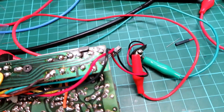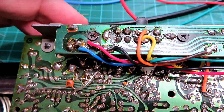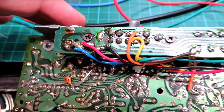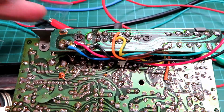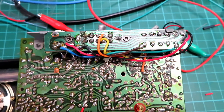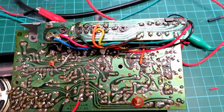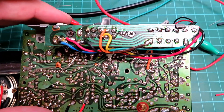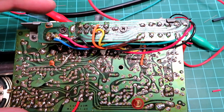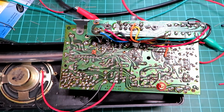I'll just try and adjust it. There we go — that's the squelch. There's no actual way of adjusting the squelch other than on the dial on the side, and there's no way of setting other thresholds according to the circuit diagram anyway. But that's good — we actually have a working squelch now, which will make testing with the other radio a lot nicer on the ear.